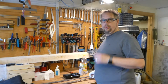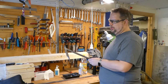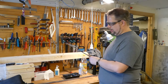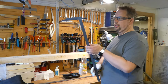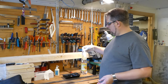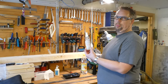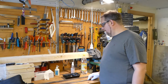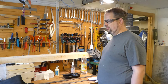I have now polished them up, degreased them. I used normal car polish to get rid of the blackness and get it nice and shiny. After that I degreased them, and I put a little bit of a layer of camellia oil that I usually use for wood planes and other things to keep rust away. So I have a thin layer of that oil on. Because I noticed when I rinse them in water, I just put them in the sun and they start to rust right away.